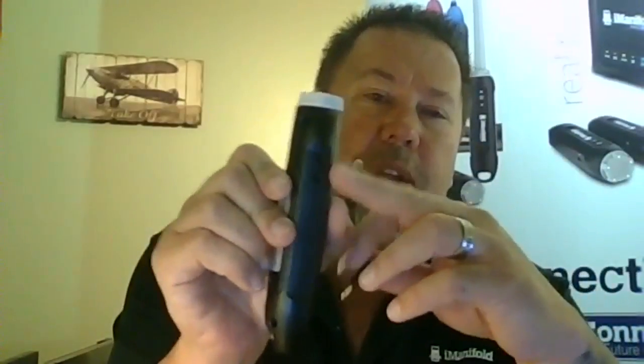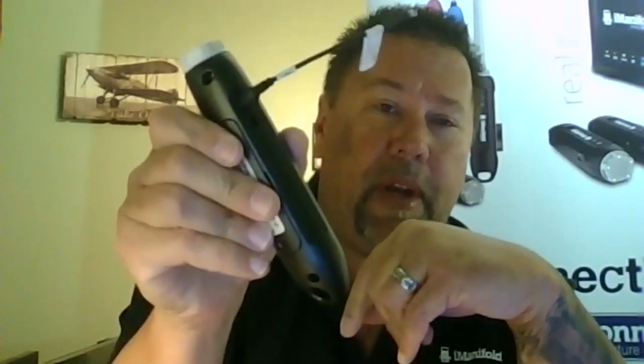You don't want it to have any reflected heat bearing upon it, or any ground heat from having it laying on the ground or anything else. So you want to get it in a place where you're getting ambient air temperature. Under a lot of circumstances, what you can do is use this on your low side probe, on T2. I personally use this on my repeater probe. Like I said, you've got two temperatures that you can map out here, and we'll just use this on our repeater probe and go ahead and plug them in here. We're going to get this system all set up to go.